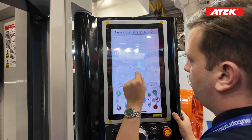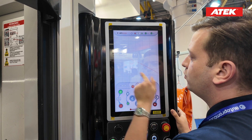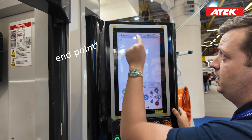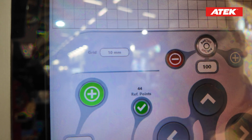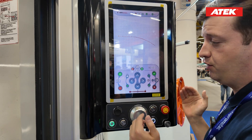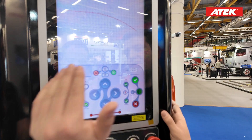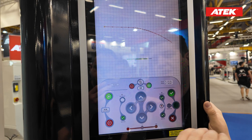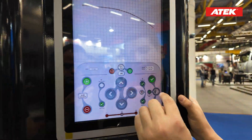I will re-optimize — I just click these points to delete them, then extend my start point. As you can see, we touched the wheel 44 times. Now I need more detail, more points for a better surface, so I change my interval to 0.4 or 0.3. When I press the Optimize Build button, the AI at the backside starts to calculate all the points and gives me a precise surface. Now we have 830 points — from 44 reference points to 830 points.